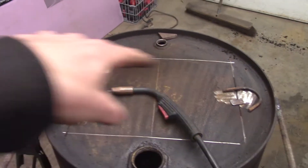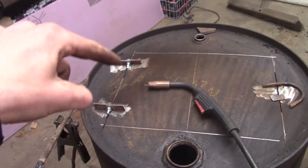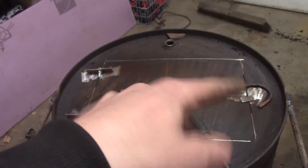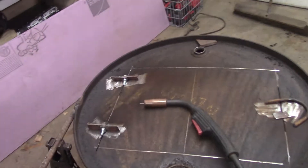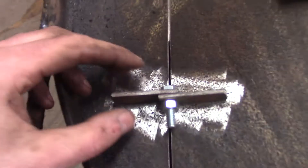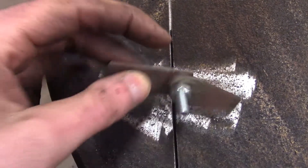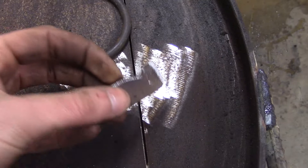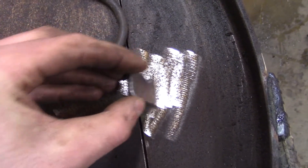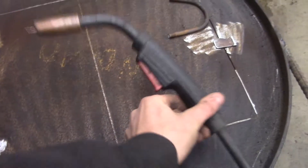Here's how we're going to do the door: I laid out where I wanted it and scored the line with an angle grinder to make a better cut line. I marked where I'm going to put the hinges and the latch, cut all the way through, and left everything else for the time being so the door stays aligned. I made some really simple hinges — just two pieces of metal with a hole drilled in, ground the corner off for clearance. Over here this will be the handle, and I have a little piece of metal with a detent ground in it that'll be welded here to latch onto the handle.